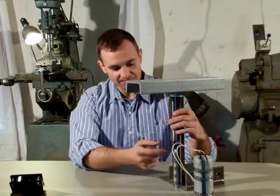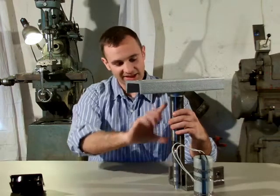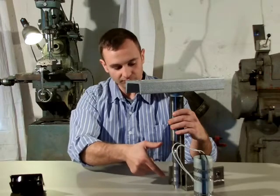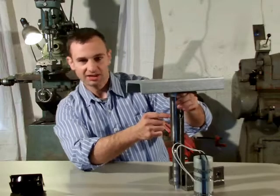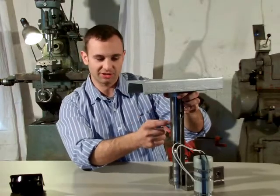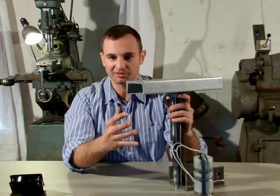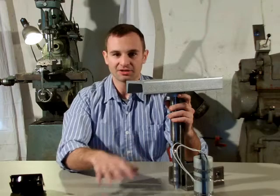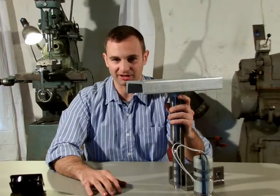So the bottom of the plunger never sees the molten plastic. It's pushing solid pellets that push the molten plastic. The reason that is done is so you can have a tolerance of about 15 thousandths of an inch between your plunger and your barrel for the fumes and the air bubbles to come out from the molten mass of the plastic, so you get maximum consistency and the best finish in your molded product.